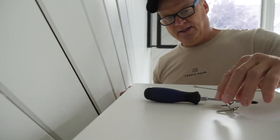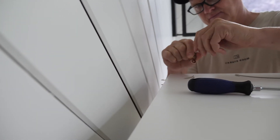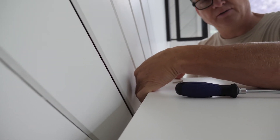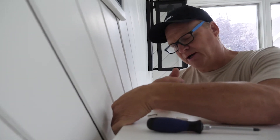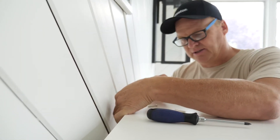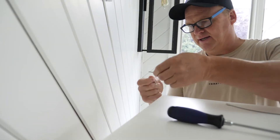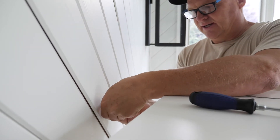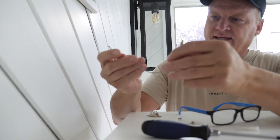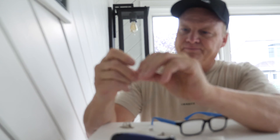Use a quarter inch drill bit and line it up, pre-attaching it to the wall. Use a pencil to mark it, then drill about half an inch into the wall with the quarter inch drill bit. Place and knock your anchor in, then use your screw — you'll pull the unit apart to do that. Use the long one-inch screw, then take the loop and loop it first, then connect it by closing it up and threading it.